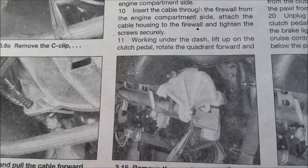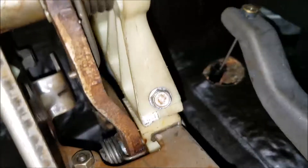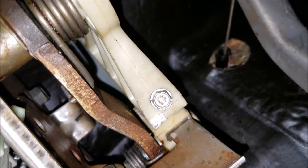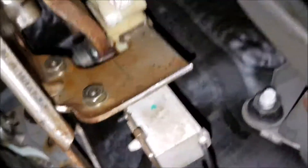So somehow I needed to secure it permanently to the quadrant and let it rotate. What I did — I got a self-tapping screw. First I took a smaller drill and drilled up there to make sure it was in line, and then I put a self-tapping screw up in there. Now it's secured to that pawl, and the pawl is secured to the quadrant.